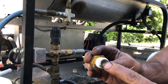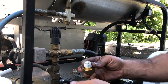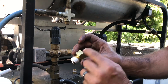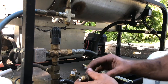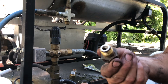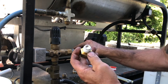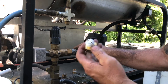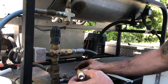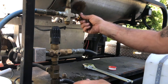Anyway, this burst disc — the new one looks like this. That material pops or breaks at a certain PSI, like maybe four or five thousand PSI, and releases the water and releases the pressure, keeping your pump from getting destroyed. That's what the one looks like that we blew. They're a one-time use, they're not cheap — they're 60 bucks — I got these from Pressure Tech, but it's a lot cheaper than replacing a $700 pump.